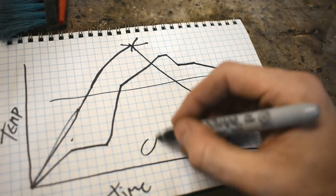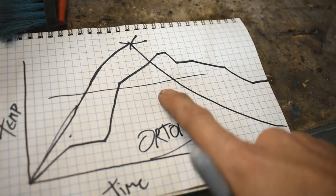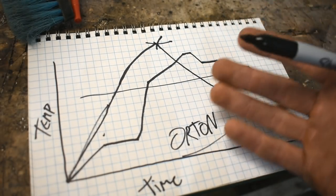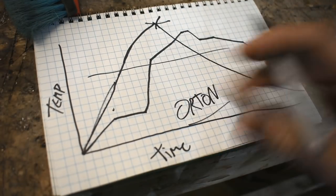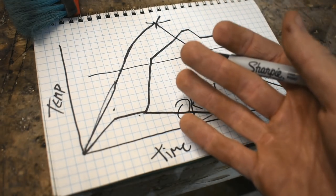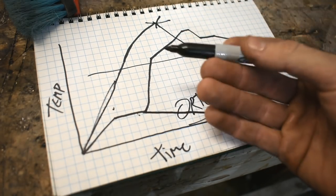And this controller, again, made by Orton, not a sponsor, but I would be happy to accept some cones, hint, hint, if you're watching. This sort of thing is impossible for me to do with any sort of accuracy with my foundry furnace. But with this controller, I forget exactly which Orton it is, but it's made by Orton. There's a bunch of other kiln controllers and furnace controllers. This can be programmed by me to do whatever I want. So let's say there's a certain metal out there that has to be heated up to this amount, and I want to hold it for a certain amount, and I want to cool it down really slowly. I can program it to do that, and it will do it very accurately, because the whole system is not designed by me. It's got a thermocouple and a computer brain and programming by some nerds with even thicker glasses.